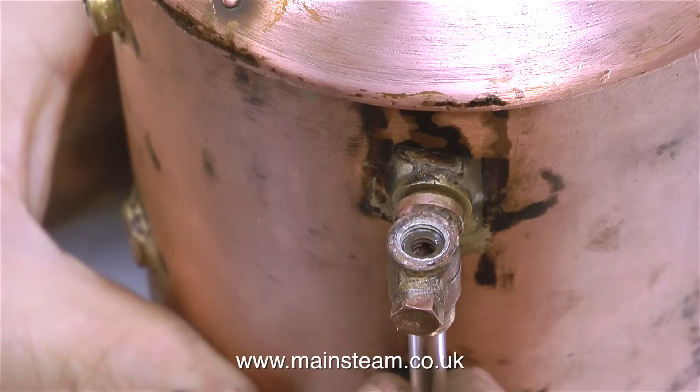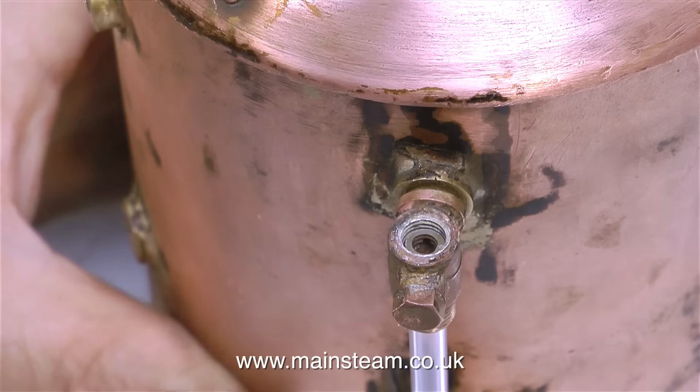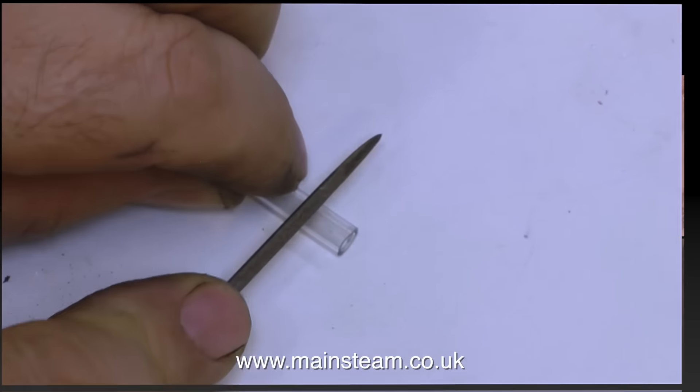When I fit the glass, it's not the right size — that's because purposely I cut it too long, to illustrate a very common problem that beginners have with fitting water gauge glasses. If you look, the top of the glass, when it's in position, covers the hole through into the boiler. Also in this particular instance the piece of glass is left far too long. Not only is it obscuring the hole into the boiler, if you were to replace the top plug with the glass this length, the plug would shatter the glass anyway.